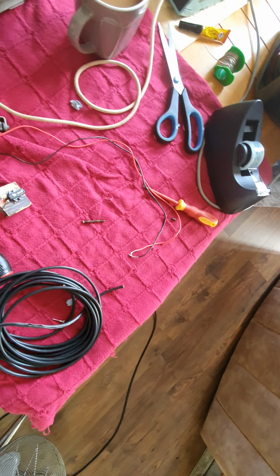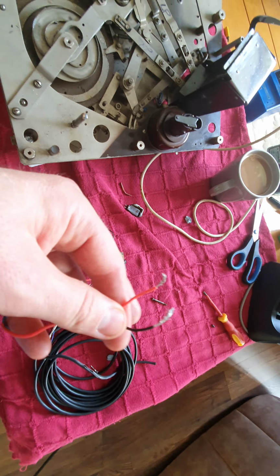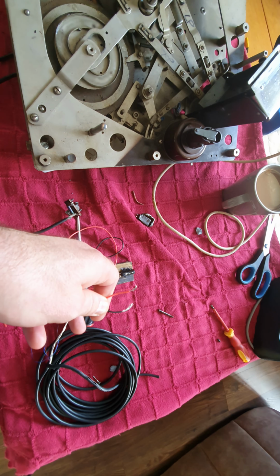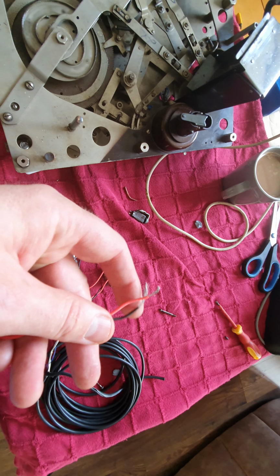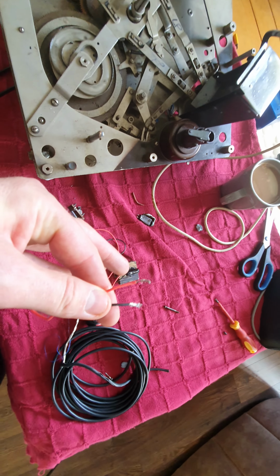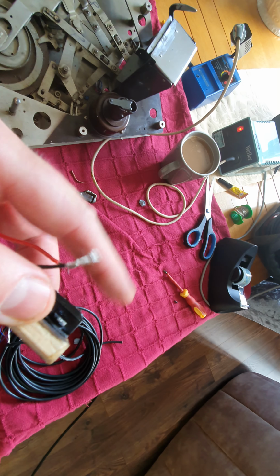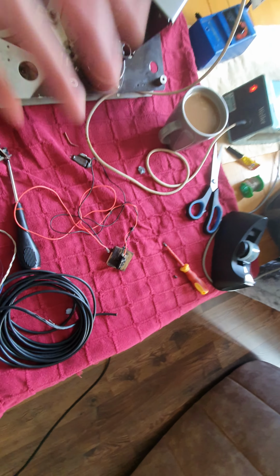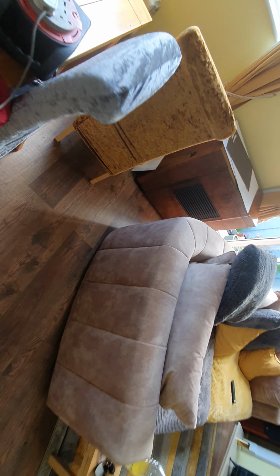So literally what I did, Steve, if you got this far with the video, without even mounting it to the board, I just soldered the 2 wires to the back of the pins, which is not ideal because it can bug up the cartridge, but I've got away with it. I connected these into the input of the back of the amplifier, and just brushed the needle with my finger to see if it works. Now, it worked on there a treat. This is exactly the same cartridge.